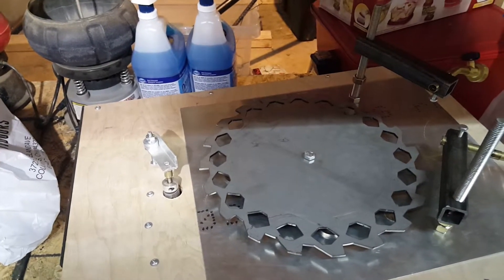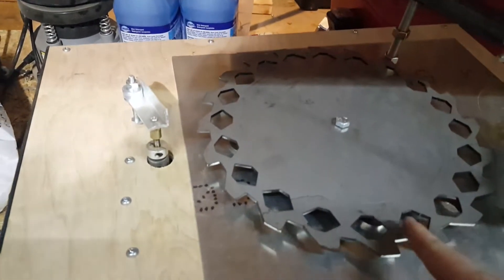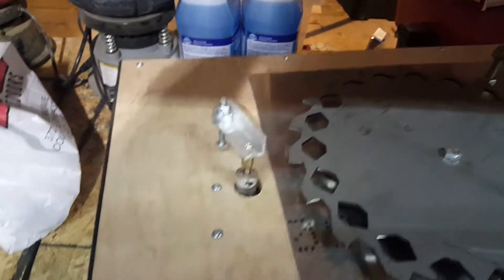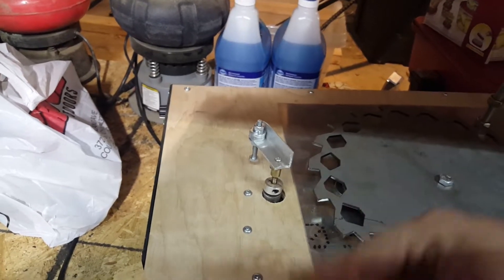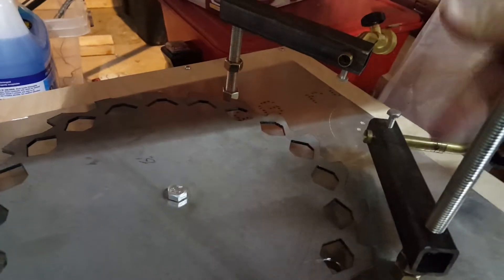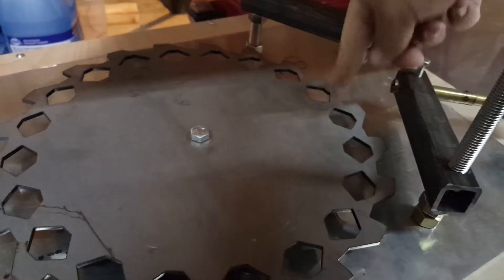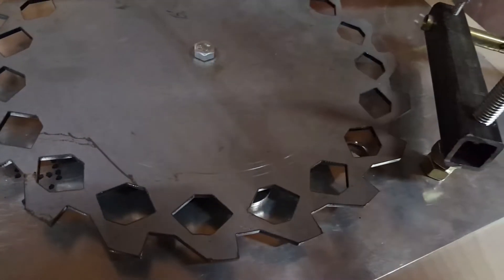Probably hundreds of people have built these. Basically what you've got is two torch holders and the plate. You have a DC motor that rotates and engages these teeth, and your case sits here — it advances one tooth per revolution. The case sits here, you've got your torches hitting it, and then the motor comes around and rotates this.